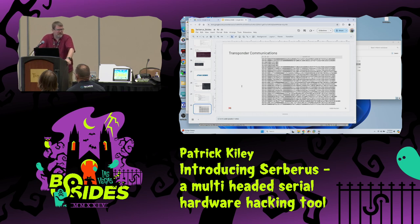This is transponder communications. Now, this particular avionics set does not have a transponder. That's by design. But if you look at the communication on this screen, you can see something right away. You'll notice that the messages always begin with 1-0, and then it's 2 or C, but if you look at where the bits line up, it's a pretty easy mask to identify. And it always ends in 1-0-0-3. So using that, it's pretty easy to actually look for that sequence of bytes and break on it and realize that you actually have the message incrementing. And I'm going to show that on the avionics here in just a second.